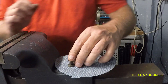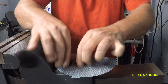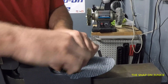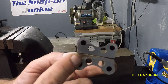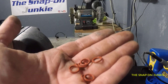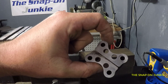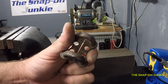Alrighty, so here's this thing. I'm going to put it on the anvil of this vise and just sand her a little smooth. We got this thing pretty flat and all blown out — the mating surfaces are all pretty good. That's what I was looking for. I got my new o-rings here, so we're going to go out, put the o-rings in first, and then try to wedge this thing back down in that little hole. Putting it back in is a little bit of a pain in the ass and will require some technique.